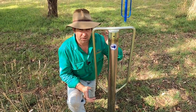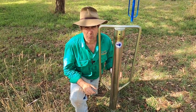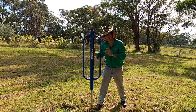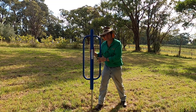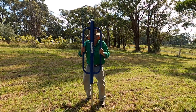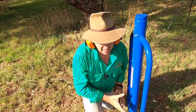I couldn't see an appreciable difference in the amount of strikes it took to get the post down to 1200mm. If you employ staff and you're worried about their hearing and OH&S, this is a clear winner in the decision-making process. This is a very cleverly designed post driver indeed. Next up we've got the 1200mm fenceday steel post driver. It's about 5 kilos heavier than the Sneddon's model, and if you're only going to be driving stock posts that 5 kilo extra weight is really going to pay off. That extra 5 kilos meant a lot less strikes on the post.